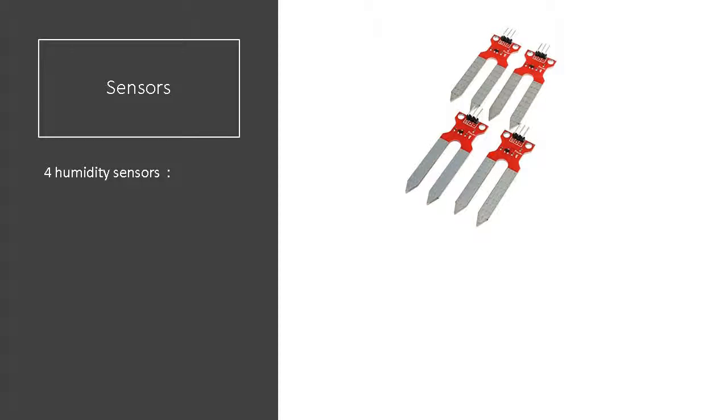The sensors are the following. We are using 4 soil humidity sensors. Even though those are normally used to get the humidity of soil, they can easily be used to detect the presence of water. Indeed, during our test, we get an analog response of 400 to 500 if the sensor's plaquette is immersed, and between 0 to 15 if it's not. Those sensors being extremely cheap, we are going to use them for our project.